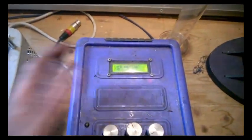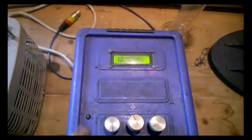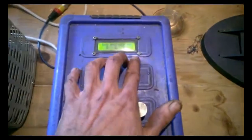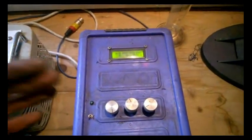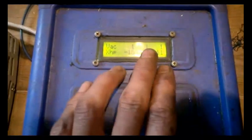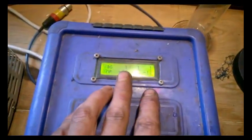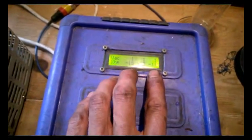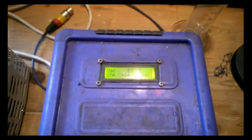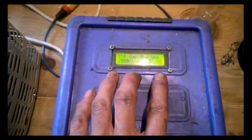This sets up our maximum and minimum positions of our carburetor so we can tell it where we want it to be. Over here we have power output — there's a set of sensors in here that records voltage and current and gives us our average RMS minimum and maximum, so we actually take sensor data fast enough to get the waveform of our power. This is our average vacuum in the middle with maximum and minimum, and underneath it is the exhaust pressure, but I haven't got anything set up for that so it's just reading random numbers at the moment.